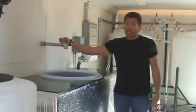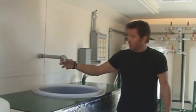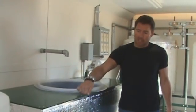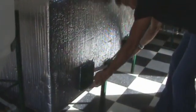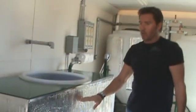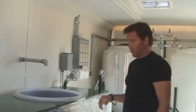This is where the raw oil actually comes in — you hook up outside the trailer with a gator hook and the oil comes in through a filter into this tank. The tank is powder coated and insulated, and has two heating elements built into it that heat the oil up in order to break loose any of the particulates that may be floating in the oil.